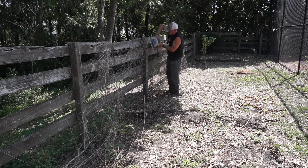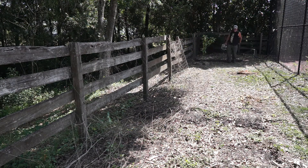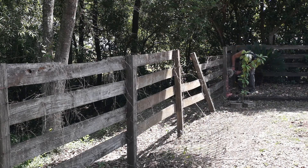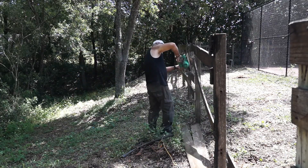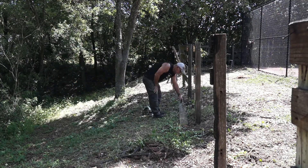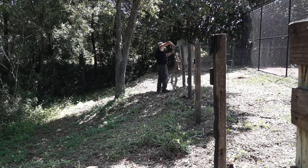The first thing I had to do was remove the metal fence from the wooden fence posts. But instead of removing every individual staple, it was just easier to put a metal carbide blade in my skill saw and cut on both sides of the post to cut the metal fencing loose. This way I can get all the metal off the fence, and then do the same thing with the wood slats — except put a wood blade back in the skill saw and cut those loose. Now with the metal fencing removed, I'm just going to go down and cut all the rails loose from the posts. I've got a burn pile off to the side where I'm taking these old rails — I think they're one-by-sixes — and burning them.